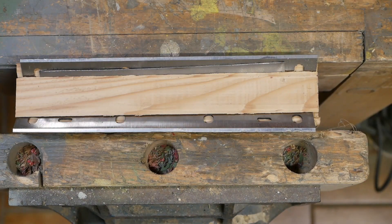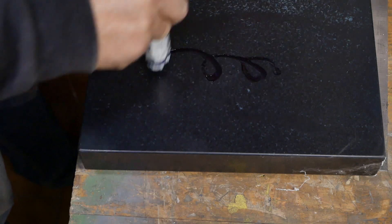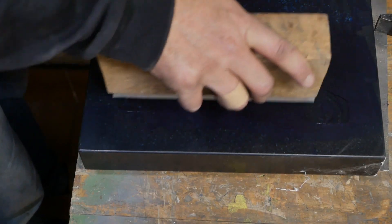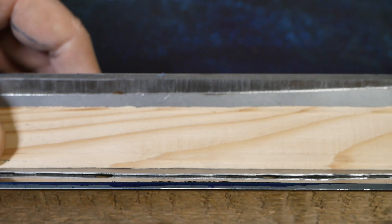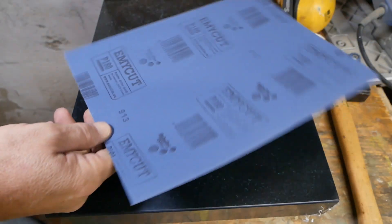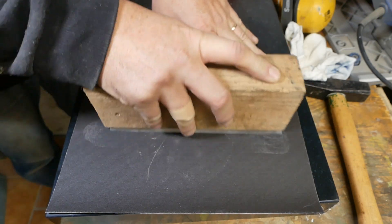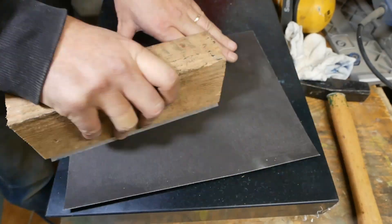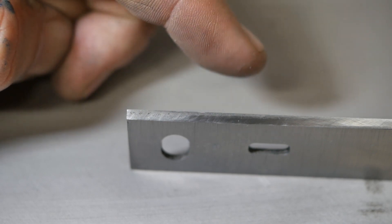These are just strips of old sheet metal to lock the blades in place. So here's my surface plate — I'll just blue this up and see whether the angle's anywhere near accurate. The angle's not quite perfect, but then again the blades are far from perfect as it is, so I'm definitely going to improve it with this grind. Because the blades are so damaged, I'll start off with 180 grit paper. I looked at doing it on the Clarkson but it doesn't have this much travel. Unfortunately those nicks were so deep that I ran out of sandpaper before I could get them out completely, but let's see if they cut better anyway.